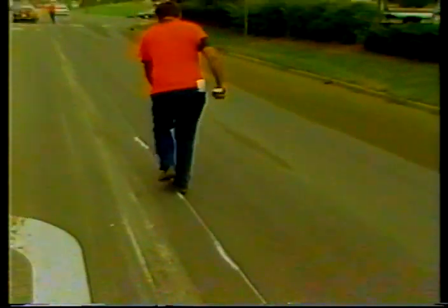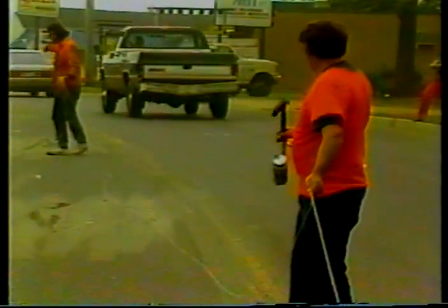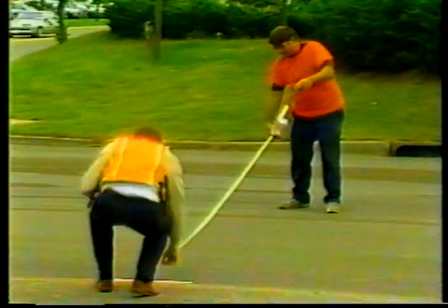The fourth inspection point: layout and pre-marking. Pre-marking is usually required only on new pavements or when a new array of markings is required — it's not necessary for remarking old lines. Sometimes pre-marking is done by the contractor, sometimes by the highway department. In any case, the layout should meet the requirements of the plans and the standards of the MUTCD.